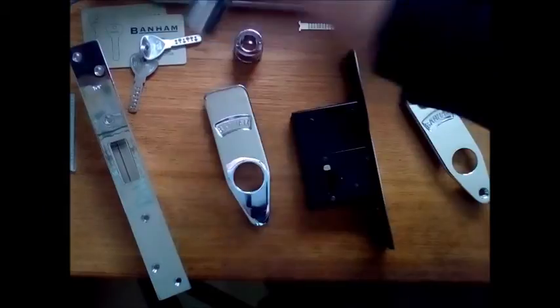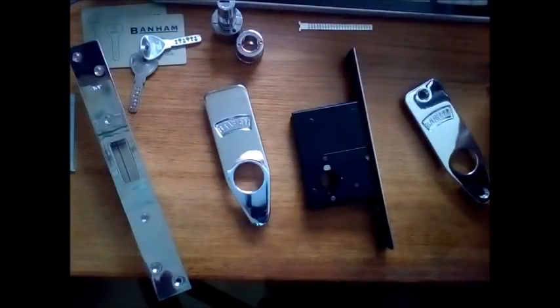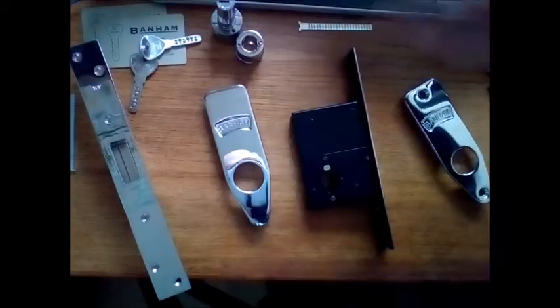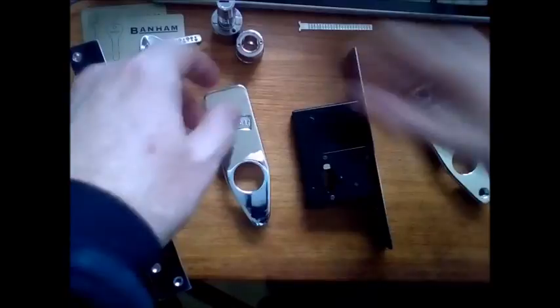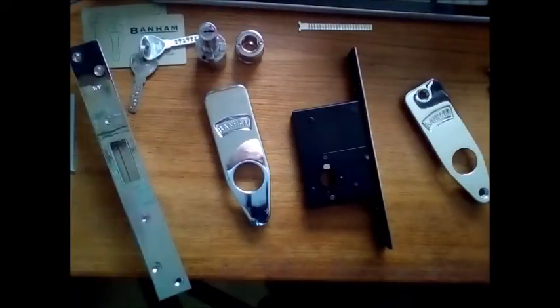The barrel is a six-pin anti-drill cylinder. It's really hard to snap because it's screwed in from the back with little screws that come with it. All the fixing screws come with it, and two locating screws go right through the lock to bolt it on. I'll do a zoomed-in version of fitting the barrel to the case as a separate video, as that part is quite tricky.